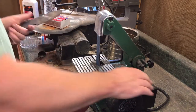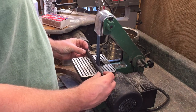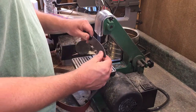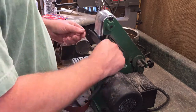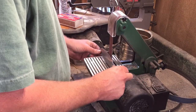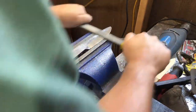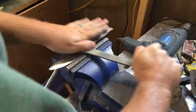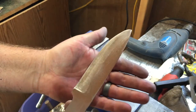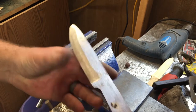After tempering in the oven at 450 for about an hour and ten minutes, I let it cool down overnight in the oven and brought it back out to the grinder. I wanted to put the best finish I could on the knife and test my own ability, since I'm pretty new to this whole craft. I wanted to do a flat grind on this blade, and I couldn't decide if I wanted to bring it all the way up to the spine or maybe just halfway. What I found was that despite all my efforts to hammer the blade flat, to grind it flat, and even to flatten it with the file, it just wasn't a clean machined flat. So getting that bevel to have a nice crisp line was pretty much impossible, at least at my skill level. As you'll see in the next video, I reworked that bevel and wound up with something I felt was really aesthetically pleasing and functional too.